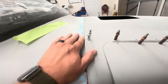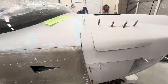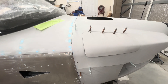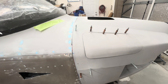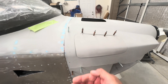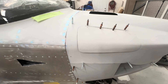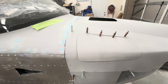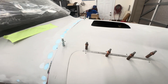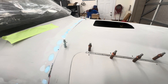Evan Brunier in his Sling build series was using the big hole and then putting washers behind there, but in some of these areas it's really hard to get your hand back there and hold the cleco. This approach just worked better for me — it's probably a time saver in the long run because I just kept dropping the washers.